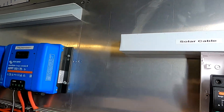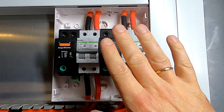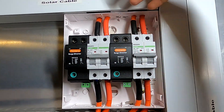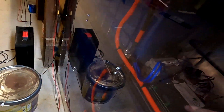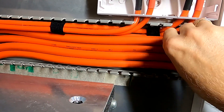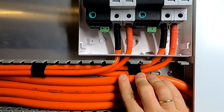I still haven't had a chance to discuss this with the electrician whether he wants to use them or not. I was going to remove them because this switchboard here is part of the shutdown procedure — if you want to shut down the whole system, you flick all four circuit breakers to disconnect the incoming solar and then drop the main switch to disconnect all your batteries. Then you are completely isolated — no incoming power, no outgoing power. But I'm not sure we can do this here; it looks fairly cramped.